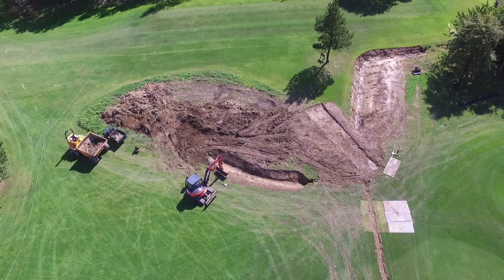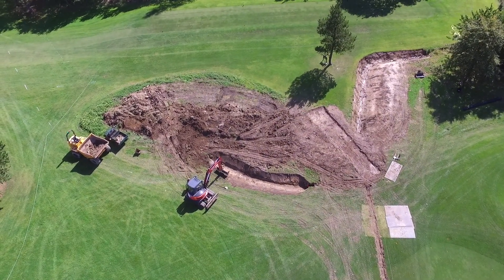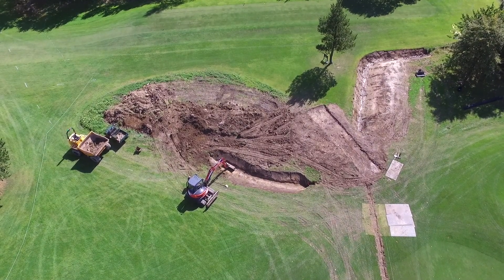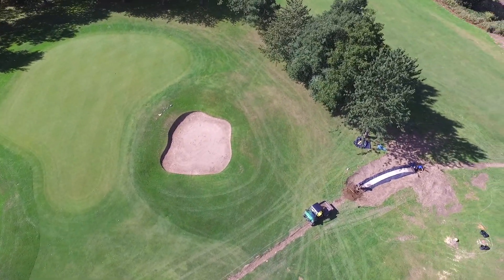We're just down on the 21st tee, and at the back of this tee is where the ditch meets the pipe section that we've installed. We've recently installed a 250 metre, 300 mil twin wall pipe section into this area, which will become the new arterial carrying section for this whole area, designed to dry up what is historically a very wet area.